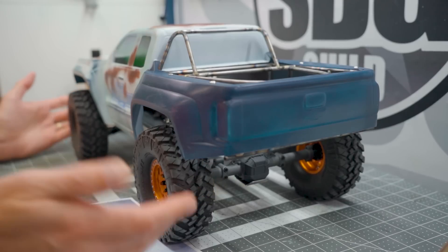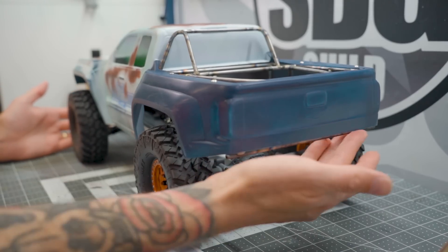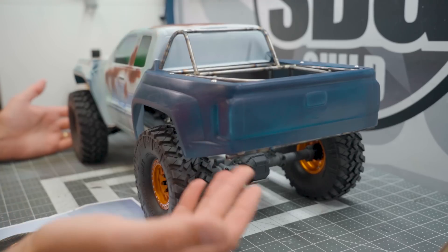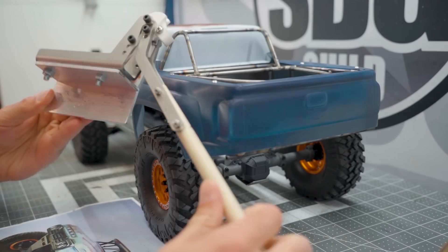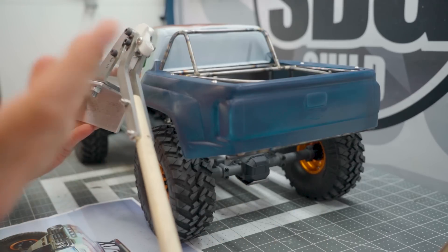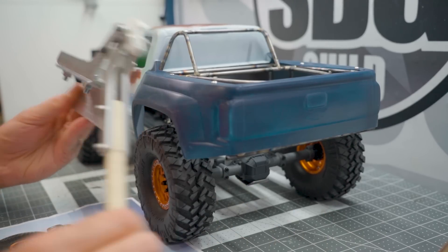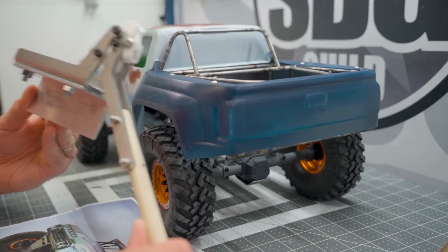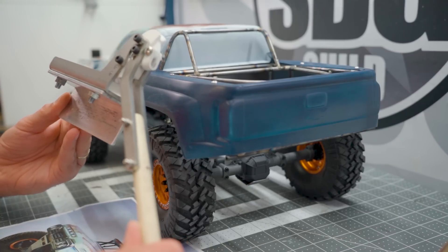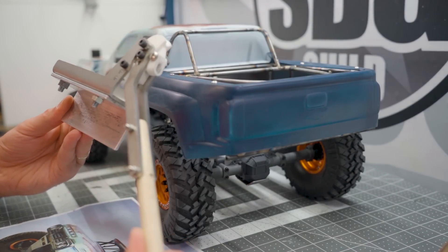I think it actually turned out pretty good. There is a little bit of a steel bumper along the bottom there. It's all 3/16ths mild steel tubing. Works really great. The bends were all done with my Oakenshield tube bender — 3D printed parts that create some very nice tight bends. I use it all the time. My thanks to Josh from Harley Designs for getting one for me. It has become something I use nearly every time I braze.